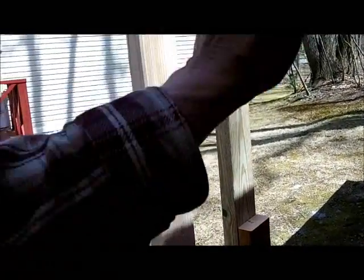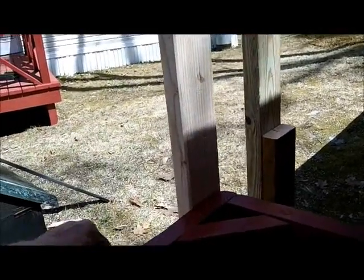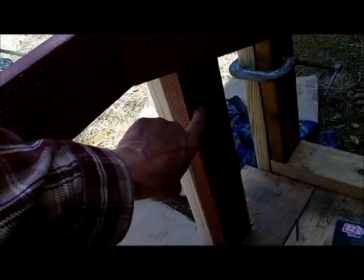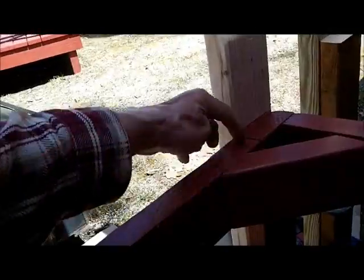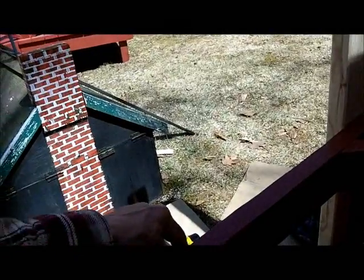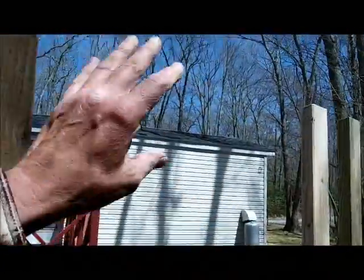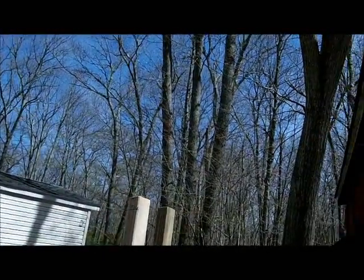I still need a lateral support for that end piece tied to this, but I don't want to come out any more than this. And these will be taken out. I'll just cut this right off here, and I'll cut this here. I think I'm just going to eliminate this thing completely. But I can't do that until I get the header in. The header is going to be all part of the wood, the framing for the roof.